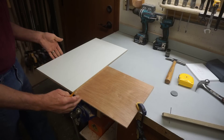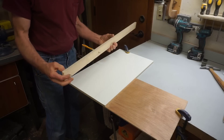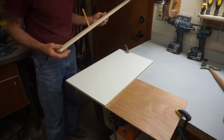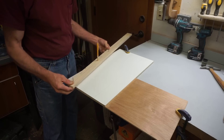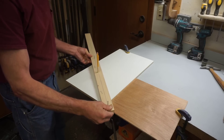If I was using a bigger scrap of MDF I wouldn't need to tack this second piece on here. And this is the cool part — once the guide stick is made and the template material is laid out with two edges that are long enough, it's just a matter of running the guide nails along the edges to draw the quarter of an ellipse.